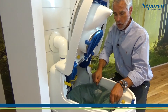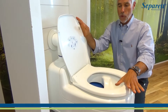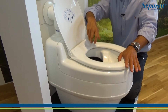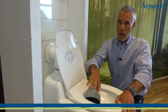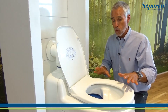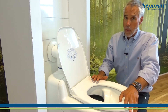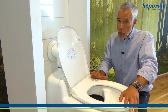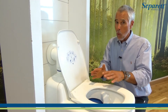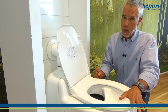This is on a rotation section, and what activates that is every time we push down on the seat, we are both opening the concealment screen to the back and rotating the bin below. That gives even distribution of the solid waste within the holding area when we lift up on the toilet. You do need to be sitting on the seat with your weight down for that to be open. If you don't, the screen's going to come back — so if you're hovering or standing up to wipe, that won't work. You need to keep pressure on the seat for the waste and the paper to go in.